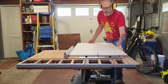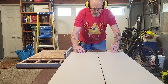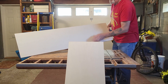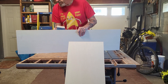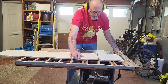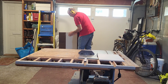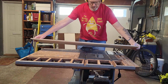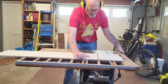I took some half-inch ply — a two by four sheet — and cut it into just under a foot, because you can't quite get a full foot once you run a blade through it. That gives me two pieces: one for the MIDI keyboard tray and one for the computer keyboard and accoutrements. After a bit of light sanding on the front and back edges, I cut these to the same width as the middle section of the desk, which proves to be a problem because the lower keyboard tray is going to be on rolling shelf rails that take up a bit of space.